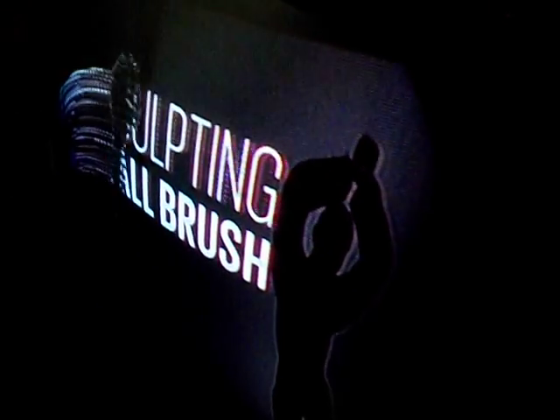That's max brightness, so you'd assume you'd have the lowest cutoff. Now I'm going to increase — 113 volts — and as you can see it's getting quite dark. Usually I have it on programming. So right at that voltage I'm at about 93 volts of bias, jumping around 108, 106. That's going to have a lot to do with the brightness of the screen — that's why I like to put it on a blank raster; it keeps it more constant.